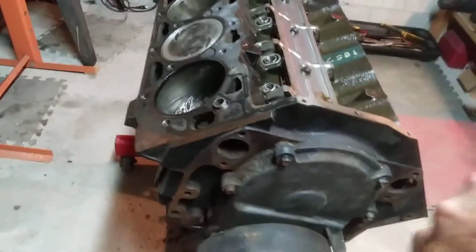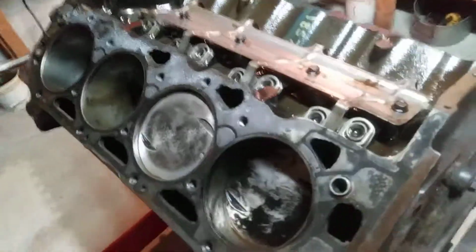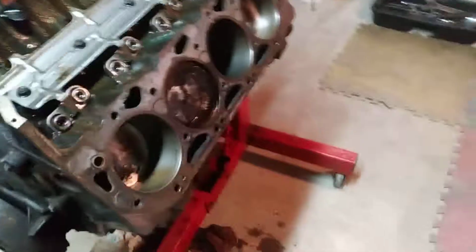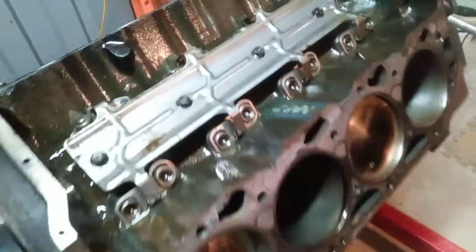Anyway, there's a lot of things it could be, but where I'm going with this is, I don't know if I'm going to be able to do this while I'm holding the camera. Let me just put the camera down. When I do a rotational mass test, I'm looking for that tight spot. I'm not going to be able to show it from this side. I'm not ambidextrous, but I'll pull through part of it with my left hand. It's real smooth. It's turning over really smooth.